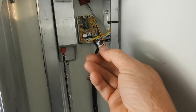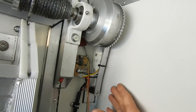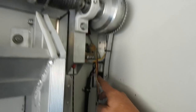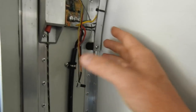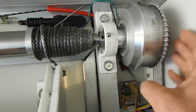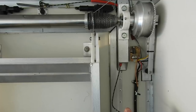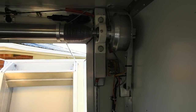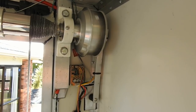This is a control with a speed control on it, but it's all temporary until I make a proper drive and control for it. This is the torque arm — torque arms are brilliant for mounting slow-speed motors. It's just an arm with a rubber isolator on the end, which allows for any slight misalignment in the motor without having to worry about coupling alignment. That's also allowed me to keep this narrow space. I'll yank on the string to open the door and you'll be able to see the torque arm taking up the slight misalignment.